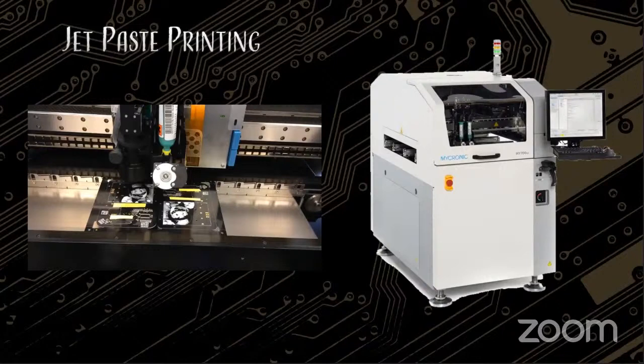For really dense boards, when the paste printer goes a little fast, you can actually slow it down to reduce solder whiskers. We have a customer with really dense parts next to each other, and we found that slowing the machine down reduces solder whiskers and allows the board to be pasted almost perfectly. So you have the ability to go fast but also slow it down depending on the design. We prefer one-to-one paste-to-pad apertures and make adjustments from there. If there are issues with the amount of paste deposited on a certain footprint, we can adjust how much to add or remove to optimize paste release for that footprint.